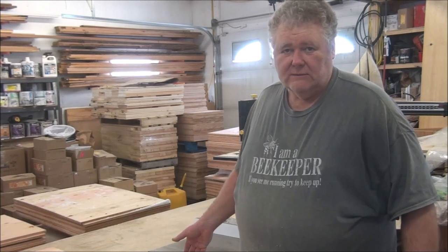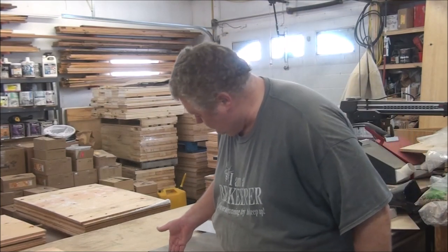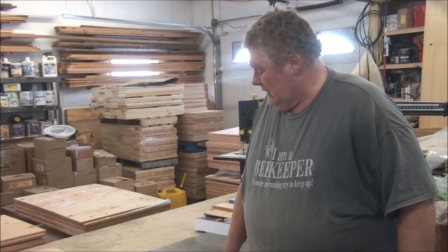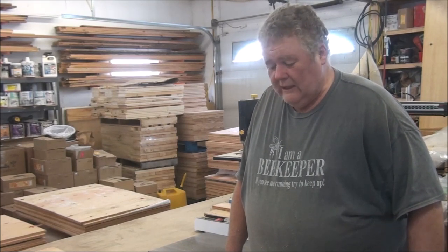It often ruins the blade, and the blade brake itself then needs to be replaced to the tune of about $105. So if you're looking at this, it's a pretty decent blade I have in here, probably $50-$75 for that blade. I really don't want that to happen. I've had it happen a few times in the past. Fortunately, it's happened with crappy blades or something. I had it happen on a blade one time, and it didn't damage the blade, and I had the blade inspected by a saw shop just to be sure. So that's the whole explanation behind bypass mode.